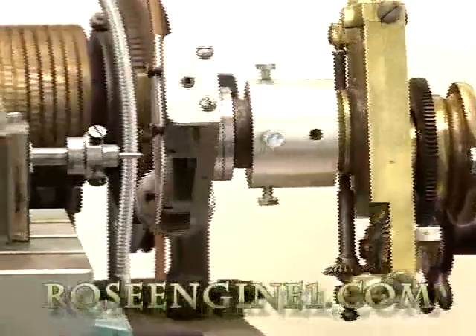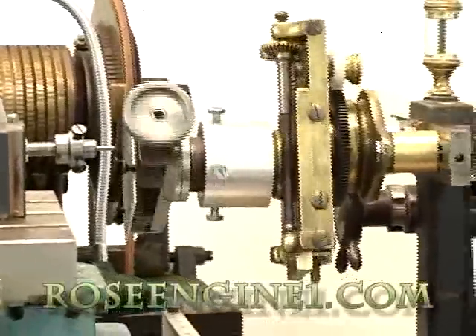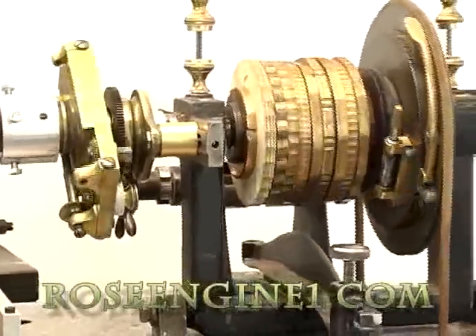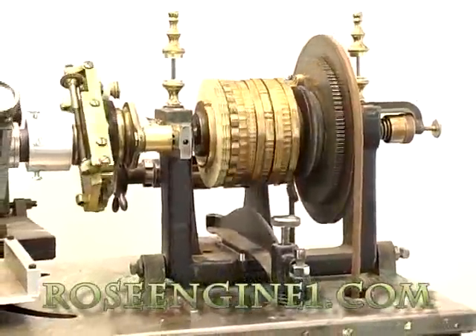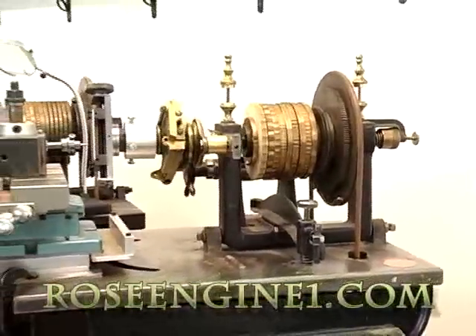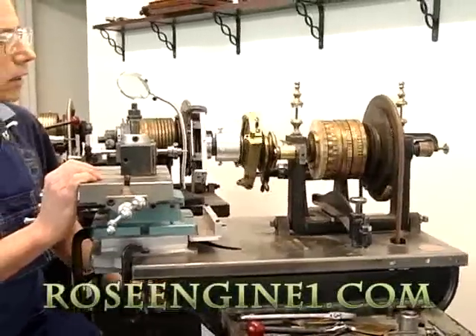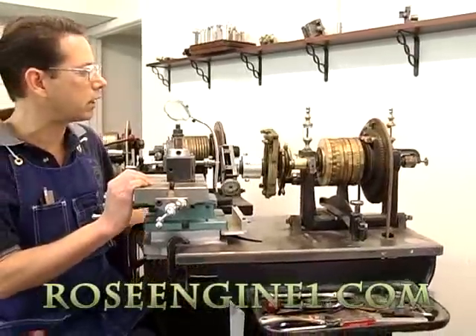So it's making small puffy stars on the guilloche cutter. As the guilloche cutter revolves, the line just continues. It's one continuous line for 144 cranks. At 144 cranks, the line is absolutely back where it started, and it creates a beautiful pattern.